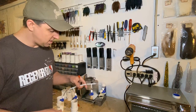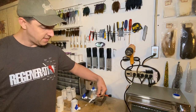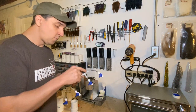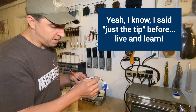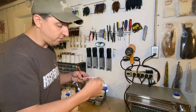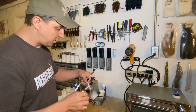We've got our finished tubing product here. This will be the main input tube for the air compressor. It goes off to the T, and we've got four valves coming off of each. That'll sit on the end and we'll run the tubes into each of the fluid beds. One thing I found: don't just heat the tip — you need to heat about an inch, at least half an inch down. As the tubing moves onto the T, you want the tubing to be loose enough even beyond that first quarter or half inch, to give you room to push it up. Move the heat gun up and down. It only takes a couple seconds, but make sure you do at least about an inch. It'll make your life a lot easier.